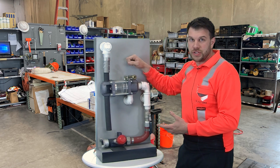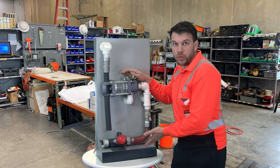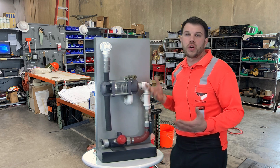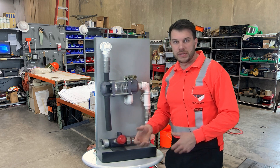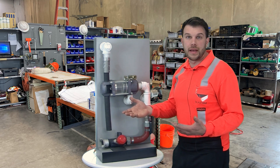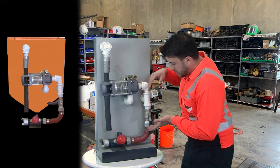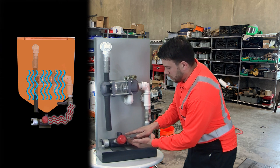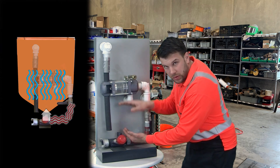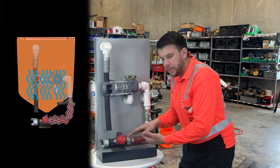This creates less pressure inside the vessel than what's actually going out of the pusher line. Customers call all the time saying their abrasive is sporadic — it's good, and then it stops, and then it's good again. What's actually happening is the updraft will lift up the abrasive, and then it'll fall back down, repeatedly. Remember, abrasive is fed like an hourglass in the whole setup.